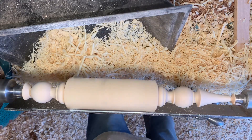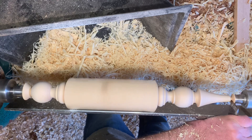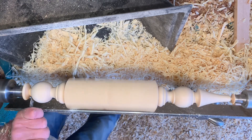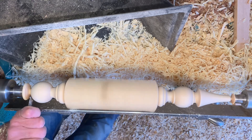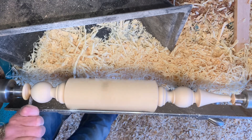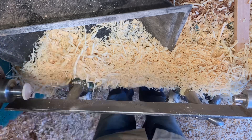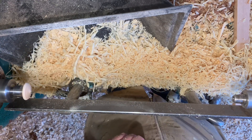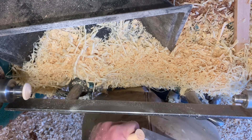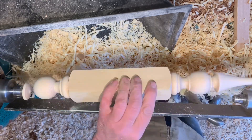We can now cut off — it's been cut off both ends. You have to be careful, so I cut off as close as I dare there. And we cut the sphere off, taking small amounts and not putting any pressure on the end to bruise it. We'll cut it off leaving a very slight nib, which I then just slice off with the skew. Slice off the other end — if there's anything left on, we can just touch it with sandpaper, and there we go.